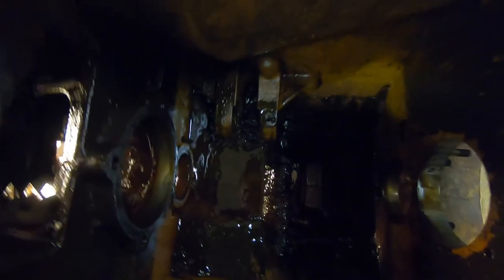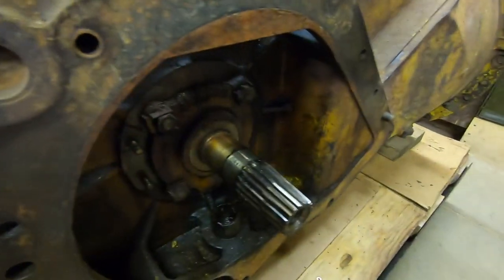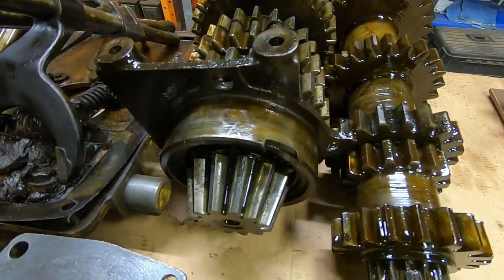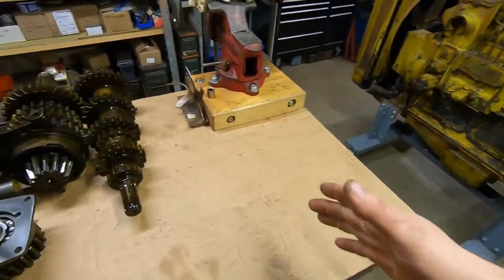With that, we've got both gear sets out of the case. There's a lot of thick stuff to clean out of the bottom, but that's pretty much to be expected. At this point only the bevel gear shaft and gear are left in there — it's not a very big compartment but there's a lot of work to get those pieces out, a lot of tools, a lot of pulling and force required, so that's going to be tomorrow's job. Honestly, I'm not quite as optimistic about the condition of these things as I was this morning — I don't like the pitting I'm seeing on there, but we've got to get that bevel gear out, get it on the bench, and have a real good look. Thanks for watching everybody — please tune in again to see that.